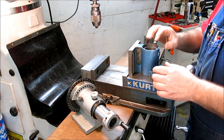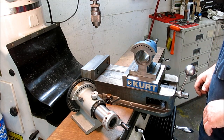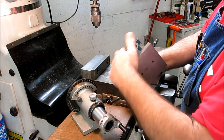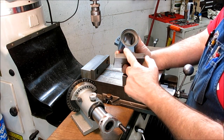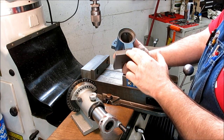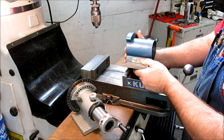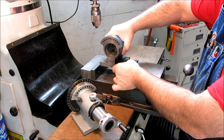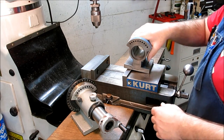Okay, so here we have these 5C spindexers, and here's one that's assembled, and here's one that I've disassembled. Now, one of the things that we have to do with this project is mount a little grooved block on the backside of this. So really what we want to do is machine this paint off of here and get a nice flat surface. And while we're at it, we want to machine these sides all the way around. The reason for that is then we can put it in the vise easily, which is a real quick way to get this up on the machine when you're using these.